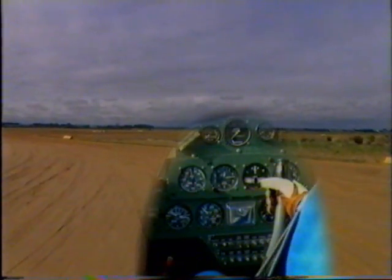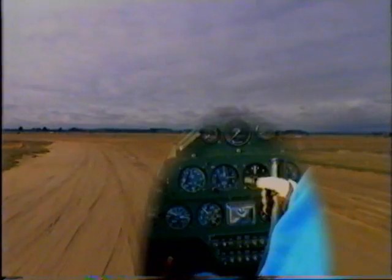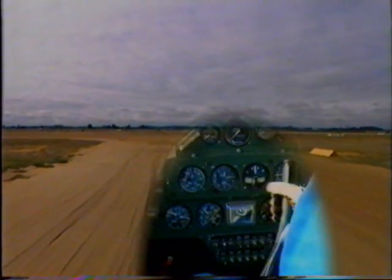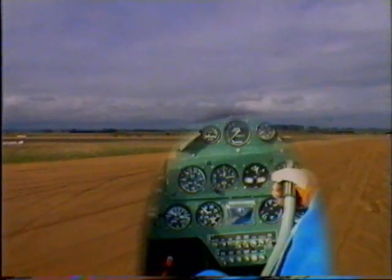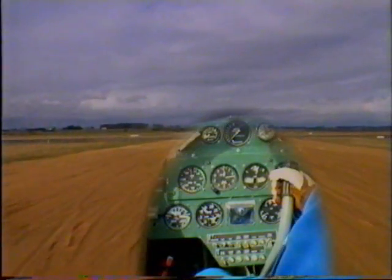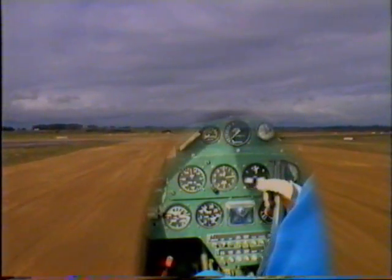Pre-takeoff checks. Start with the aircraft trim, checking the trim is set for takeoff in the center. Our mixture is in rich. Master switches are on, magneto switches are both. Fuel we have set on both for takeoff, and enough fuel for the flight. Flaps checked all the way through and set for takeoff. Instruments are all set and checked.